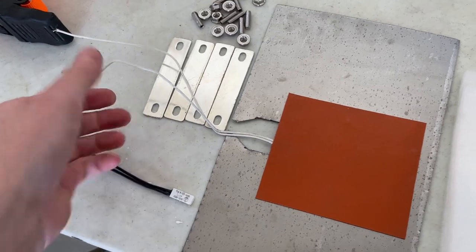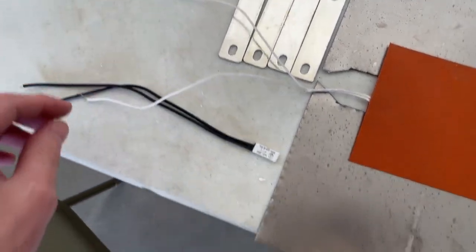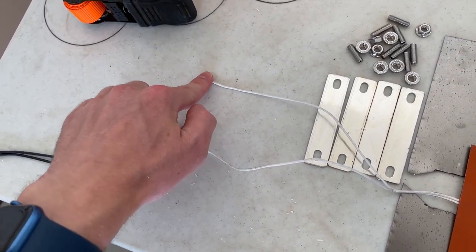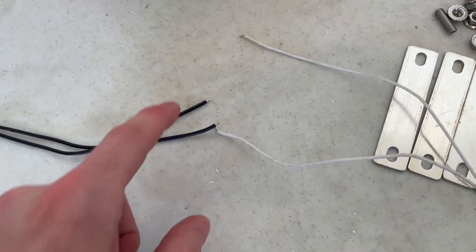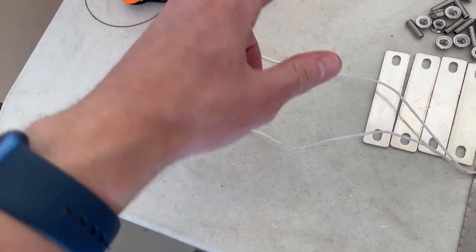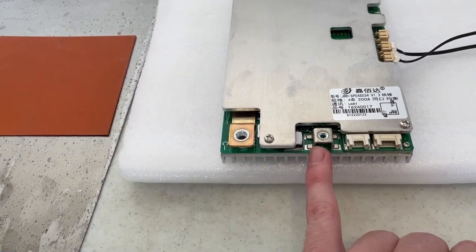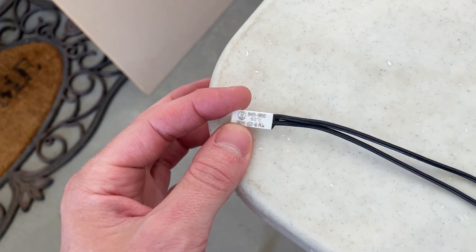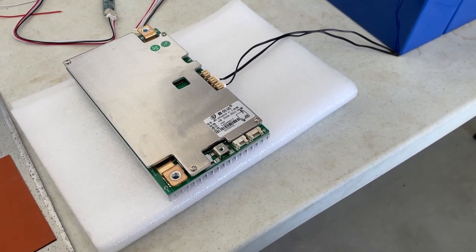So from here, how you would wire the heating circuit: you have your two leads coming off of the cutoff switch — they're bi-directional, you don't have to worry about polarity. You would hook one up here, the other one to the terminal right there with a crimped eyelet, and run the other to a fused positive connection. That way it has a constant fused positive connection, and all it's waiting for is this board to complete the circuit by activating the negative terminal on the BMS. That's exactly what this component is for — it came with no information when I purchased it, so hopefully that helps.